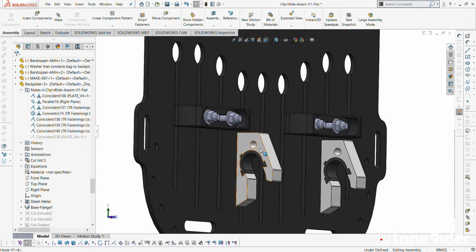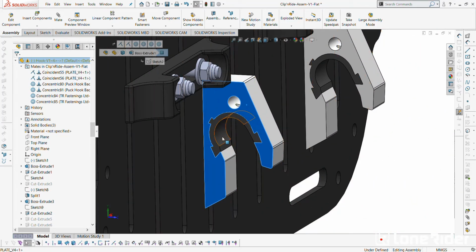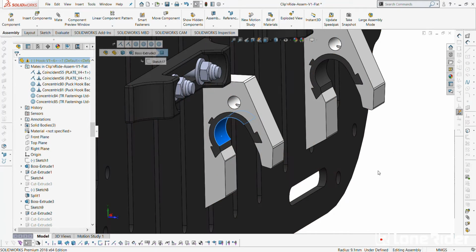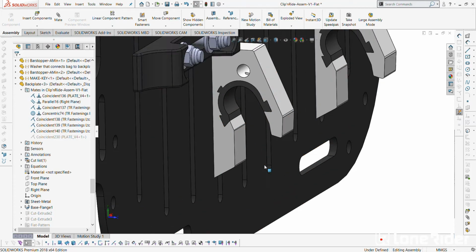So the hook is made out of 2 parts. We've got aluminium here. This will be made out of extrusion aluminium, so we just make a tool in the shape of this blue area, and it pushes and squirts out a big long profile, and then it's cut into smaller parts, and that's basically it. Just a couple of holes in the back. Pretty simple, pretty sturdy, and we can control the material quite well. And then it's got a nylon insert, because I just hate the sound of metal on metal when you're riding. It ruins the flow, and takes your concentration away from things that you should be concentrating on, the road, not annoying sounds.